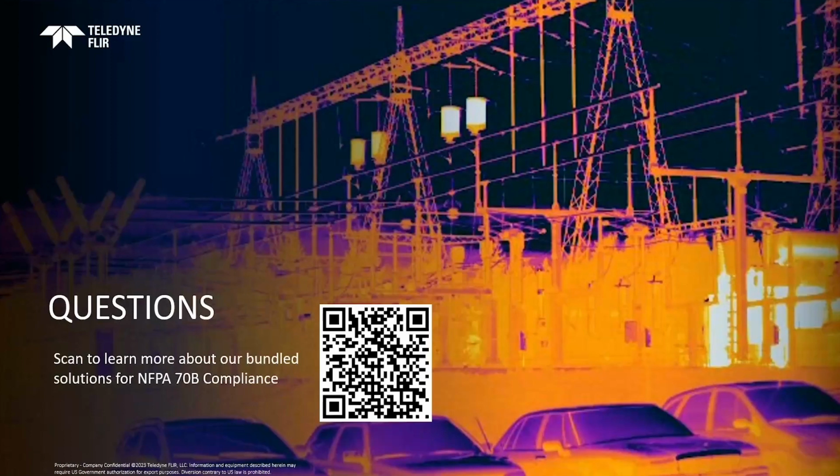But really, the question that I have, where most folks are, is: where do I get started when it comes to compliance with NFPA 70B, John? Well, becoming compliant with a standard like this begins with equipment training. It begins also with identifying what components you have that need to be maintained electrically. And what kind of test equipment do we need to get started? An infrared camera, a multimeter, the ability to measure current. There might be some other equipment, but those would be some of the basics that you would need.